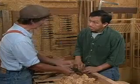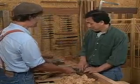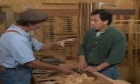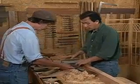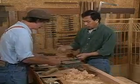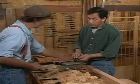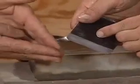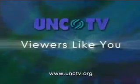Now, sharpening. This has got to be incredibly sharp to be able to cut so fine. That's right, Roy. Could you show just a little bit about that? I know, as in Western sharpening, you're just going from one abrasive from coarse to finer, but could we go to the final stone? That's correct. I'm now using ceramic stones to create the geometry that is the sharpness, which is one flat plane intersecting another flat plane. So they really just have to come down to that last point. Exactly. Two straight lines.